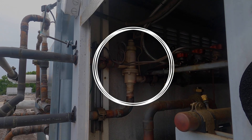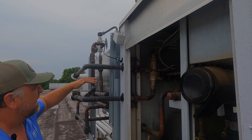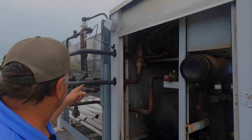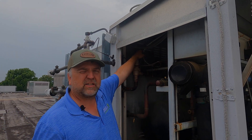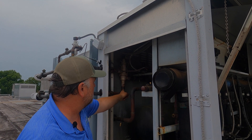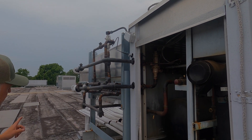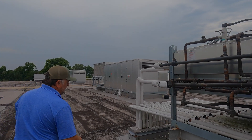That's our three-way heat reclaim valve. This line is cold to the touch; this line is hot to the touch. Right now the discharge gas is coming off our compressors, coming through here, hitting that valve, and going to our condensers. When I apply voltage to this, it's going to open up a piston, close this side off, open the other side, and send hot gas through this pipe down into the store.